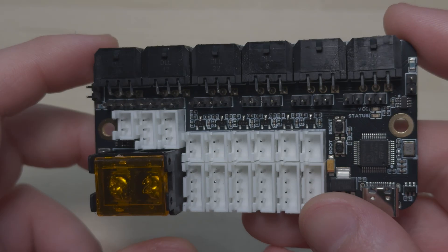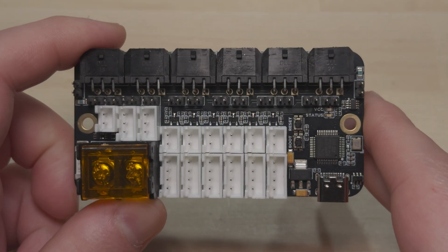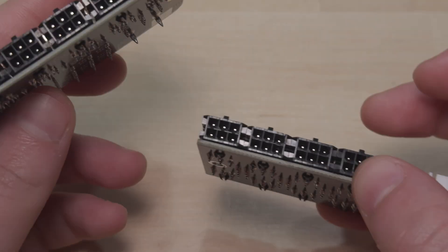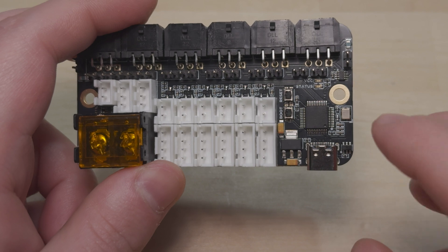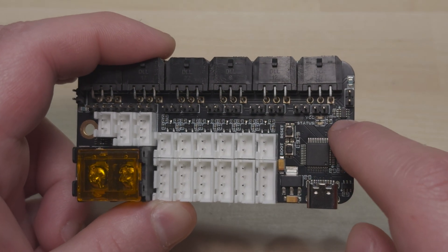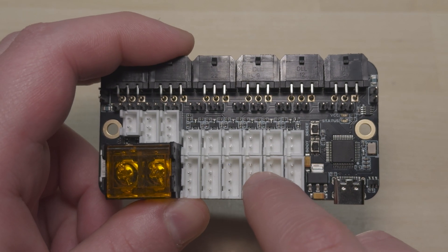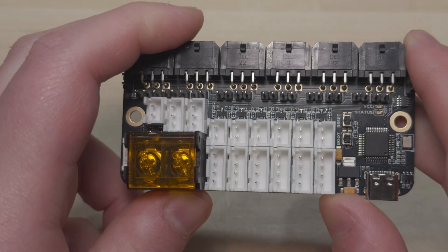Burst Nest CAN is a six-port CAN hub, USB-to-CAN adapter, and a bunch of GPIO all in a single compact PCB. It follows the exact same footprint as the Burst Nest USB, just designed for CAN tool heads instead of USB. It has the six-pin connectors just like the More CAN — a pair of CAN lines on each side with power in the middle. The USB-to-CAN adapter is built in: there's an STM32 G0B1 MCU on which you flash Klipper in bridge mode, plus a CAN transceiver, so you don't need a separate adapter like a Toucan, Pi CAN, or UTOC.